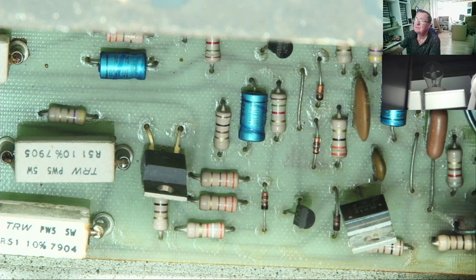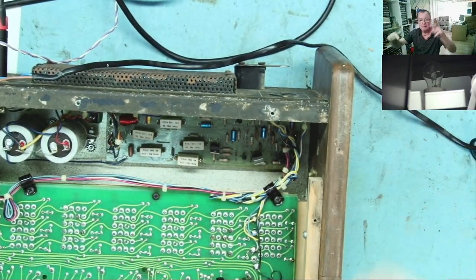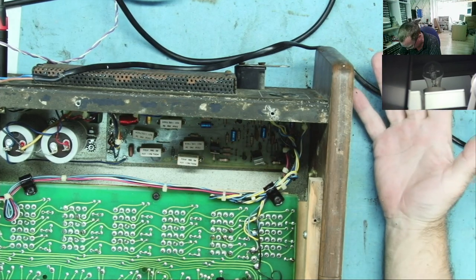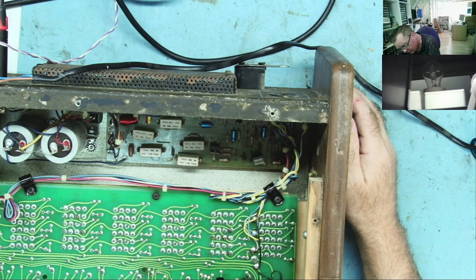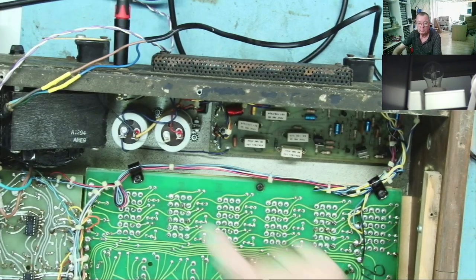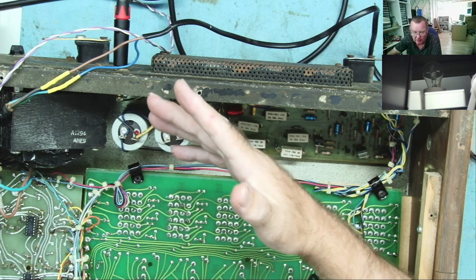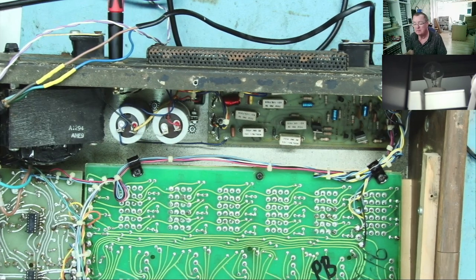It could be down to the fact I don't have this grounded because it's on my isolation transformer. But that doesn't normally happen. I repair a lot of amplifiers. I don't have a problem with that at all. Let's have a look on these capacitors with the oscilloscope, see if there's a lot of ripple on the mains, even when there's no load. That'd be interesting.